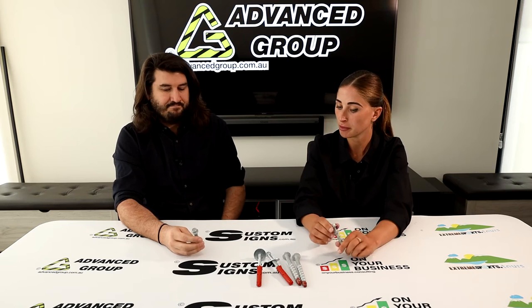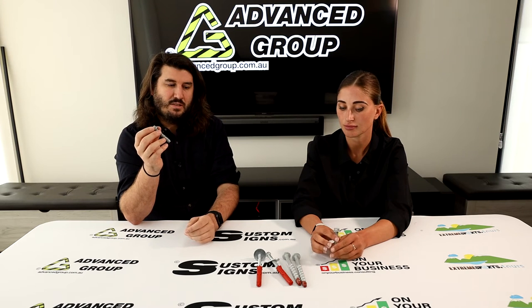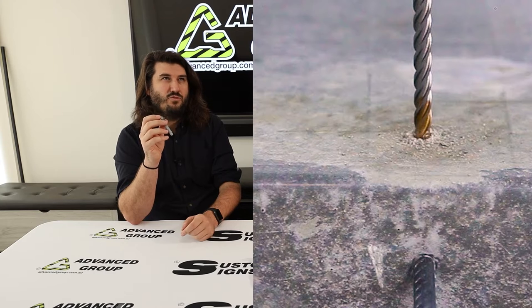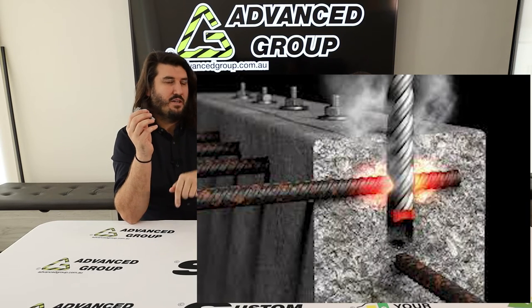To install them you would use a 10mm or M10 rotary hammer drill bit, or SDS bit typically. You can get two different types of SDS bits: one has a straight piece of tungsten as the cutting tooth that grinds the concrete, but I've had trouble with that style getting stuck when rebar is about 60mm under the surface. There is a drill bit that has an X-shaped tungsten tip — those don't get stuck as much when going past the rebar.